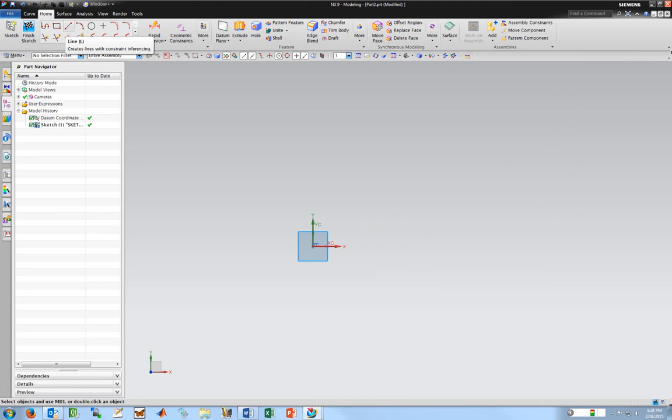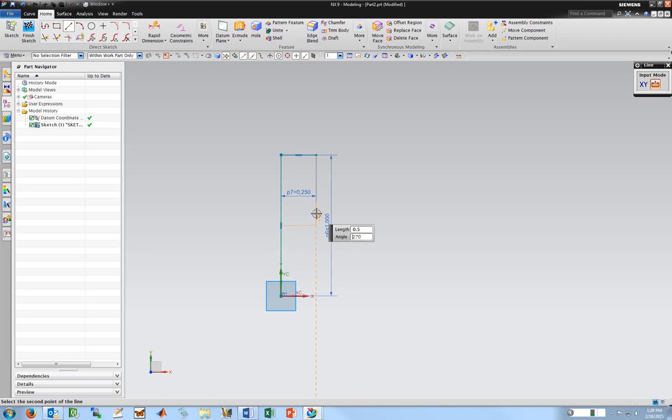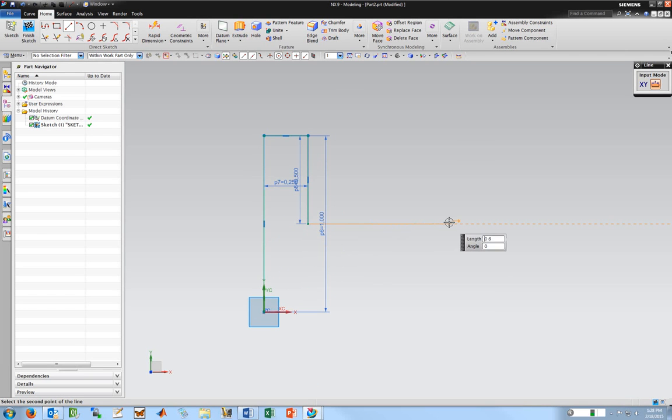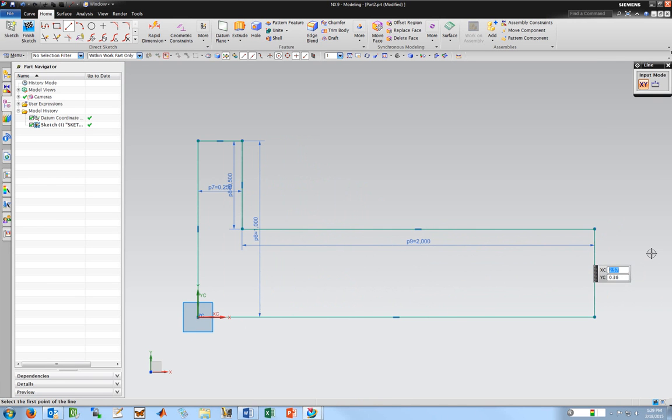I'm going to draw a peg with a flange that connects to this thing. It's going to have the same bolt circle and kind of look similar, but with an extension. I'll use this as a revolved part, so I'll start with a line. I'll start at the origin and come up 1 inch — since the other part was 2-inch diameter. Then another line 0.25 over, then come down 0.5, then go 2 inches. I need to get this back to the starting point — note that if I get close it picks up the constraint and snaps down, which is what I want. I've got my loop of curves, so I'll go ahead and revolve this now.